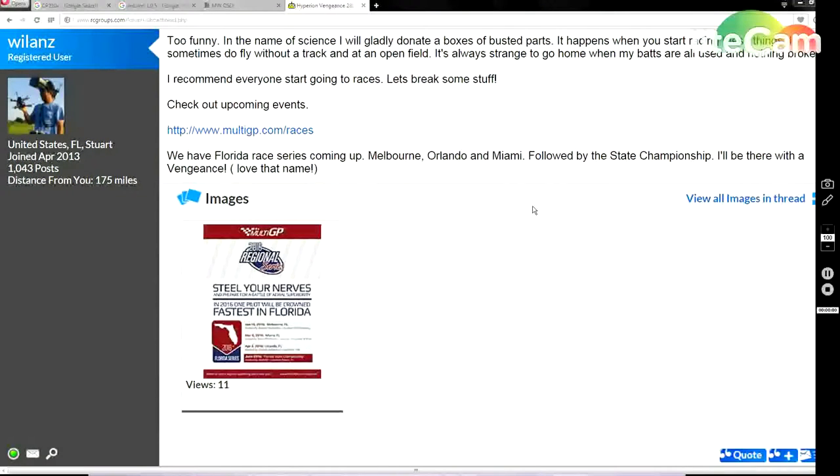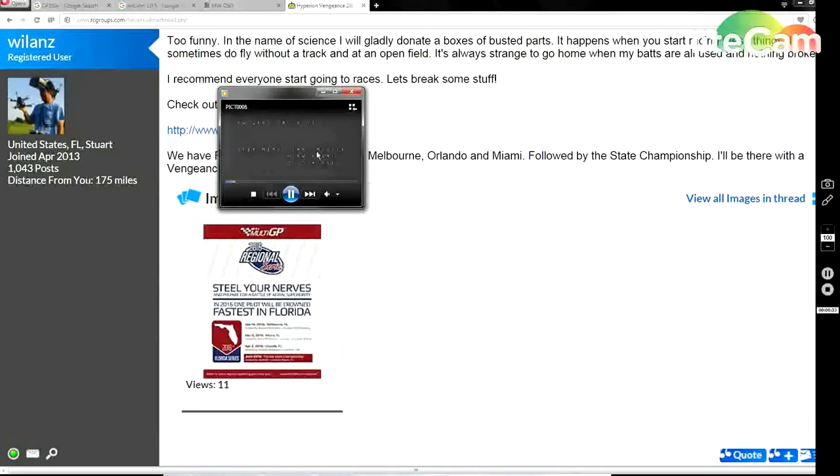Alright guys, today I received the main board in the mail that Will and RC Groups donated, and I set the dip switches to the OSD configuration, and I went ahead and checked everything out. It seemed fine, so I flashed the firmware, and went to version 1.5 with MWOSD firmware, and it seemed to flash fine. Can't talk to the flight controller, because the flight controller is completely burned out on the board, but it seemed to look, you know, like it worked, and this is what it looks like.